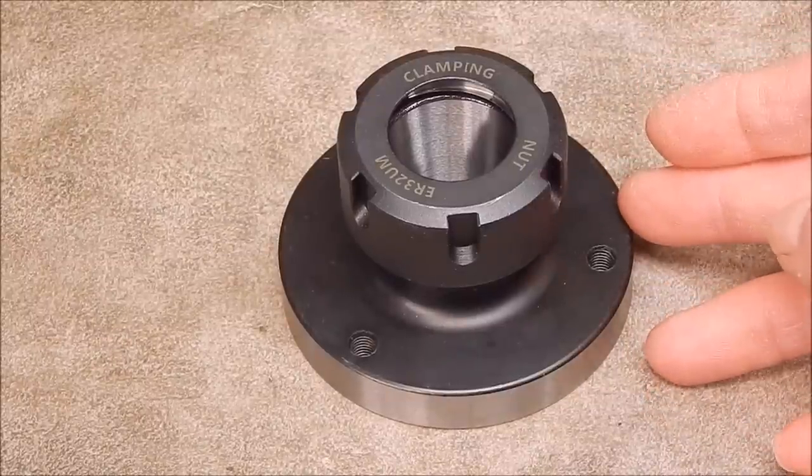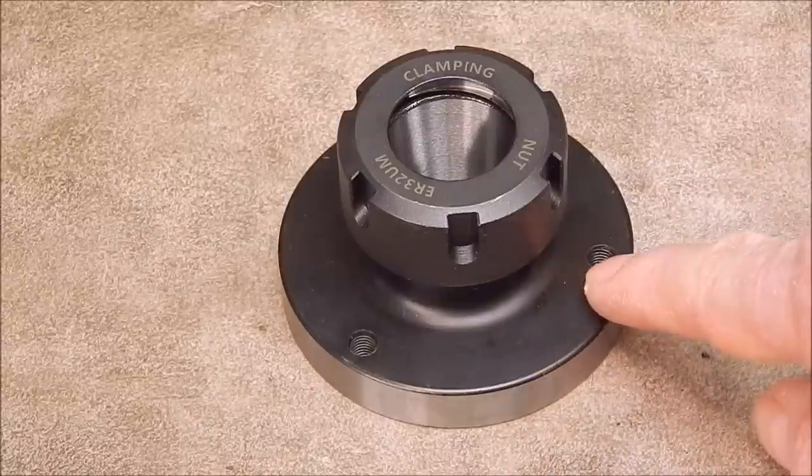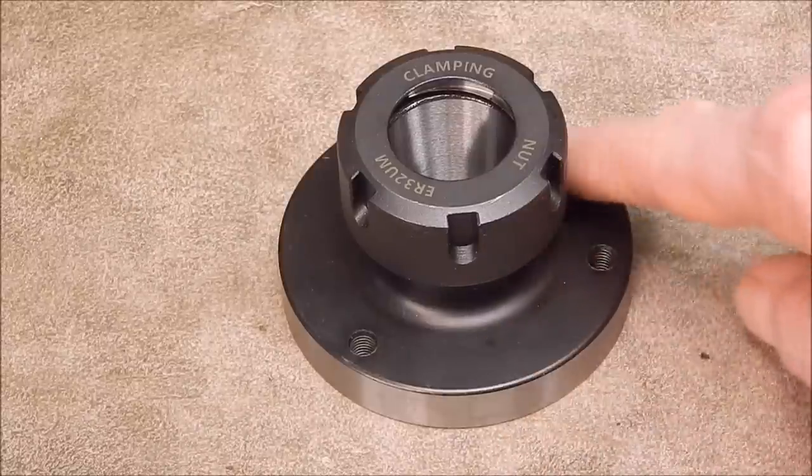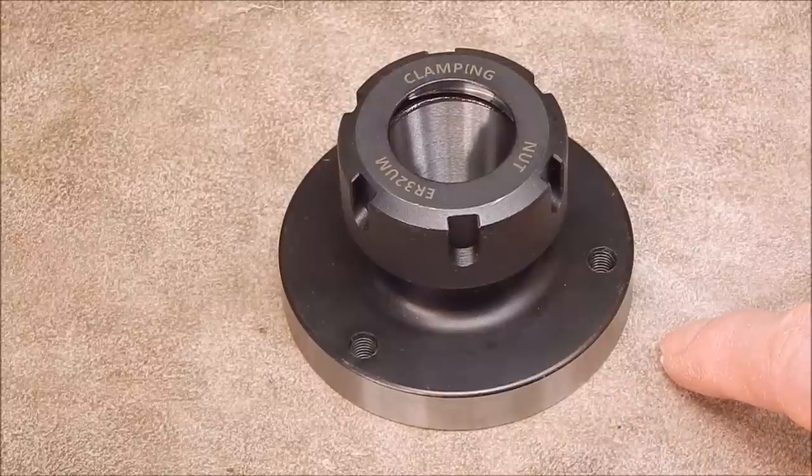The profile may not fit your driving plate. You can make an adapter plate to go between the bolt-up collet chuck and the driving plate on your lathe. So all things are possible.